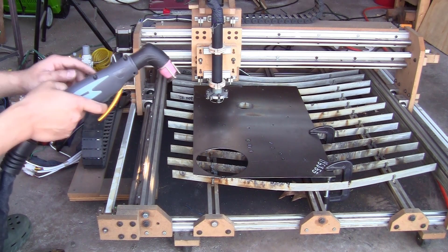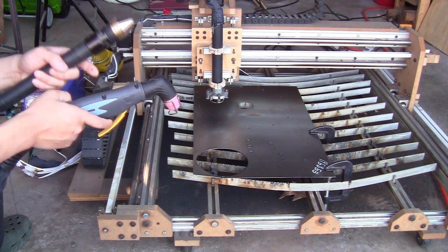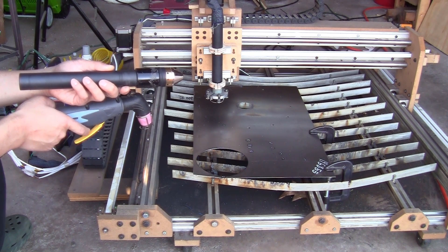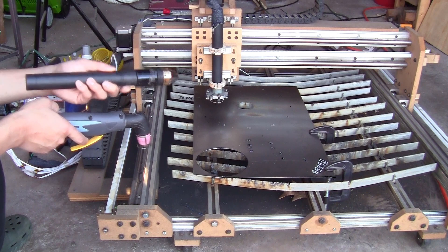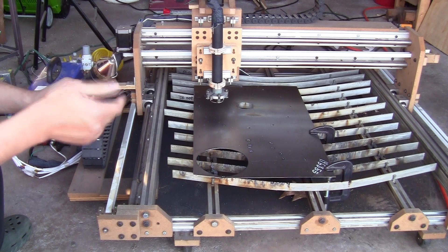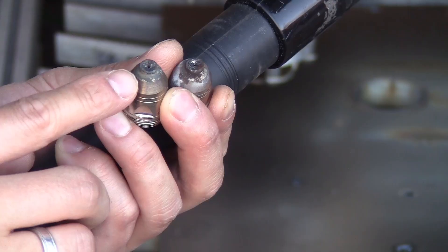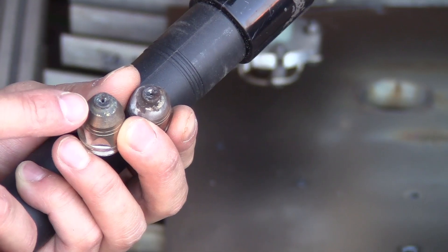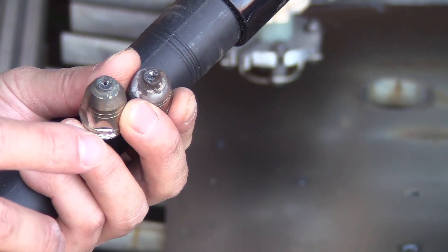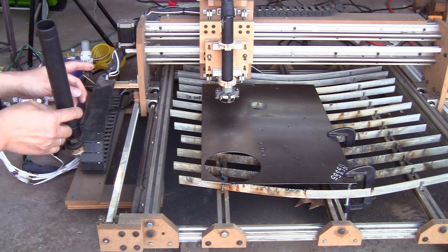This plasma cutter originally comes with a standard torch, but to make the CNC plasma cutting table easier to use, I replaced it with a PAD straight torch that I bought from eBay for a very cheap price — only $30. It comes with all the wires and cables you need to start cutting, but the one thing I didn't like about this torch is that the consumables burn out very fast. The nozzle got melted and deformed very quickly after only a few cuts, causing the arc to come out tilted so the cut quality was not good.